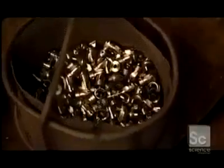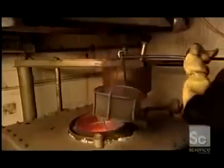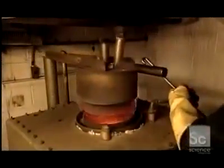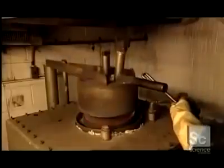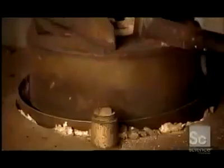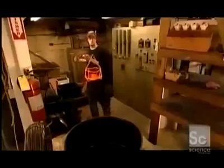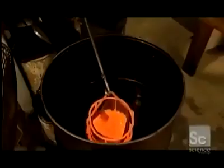Whereas the drills are made of a different type of steel that's already hard enough, the countersinks and plug cutters must undergo a heat treating process to harden, about 20 minutes in a fiery oven, along with a secret recipe of chemicals. The intense heat, 1750 degrees Fahrenheit, transforms those chemicals into gases which then permeate and harden the steel.